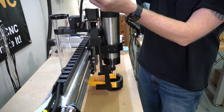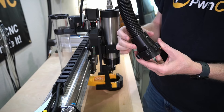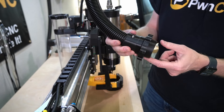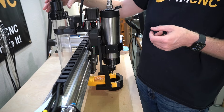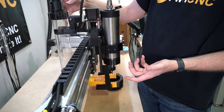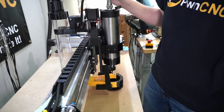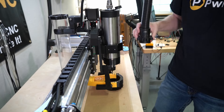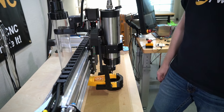Then your hose comes down. What I've got here is the Maglock converter and the Fein Turbo One extractor with its hose coming down. We've got our boot adapter with the Maglock converter, which allows me to just plug it right in. If you didn't buy that, it comes with the standard Maglock round adapter — just a two and a half inch — and you would band clamp one of your flex hoses from Amazon. The idea of the tube is it puts the hose attachment right up at the top so you can reach over from the front of your machine, grab the boot, do a little cleanup if you got enthusiastic with your carve and overwhelmed the boot, then put it back and you're back to carving with full dust collection.